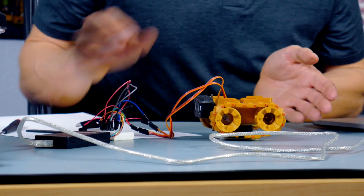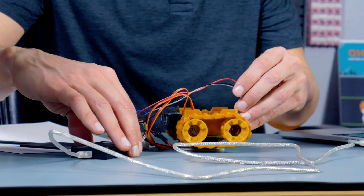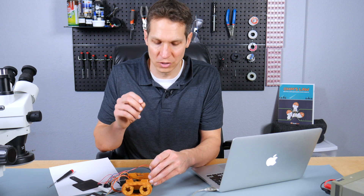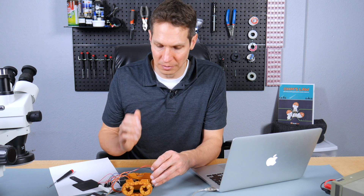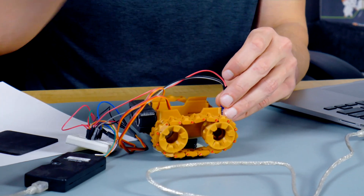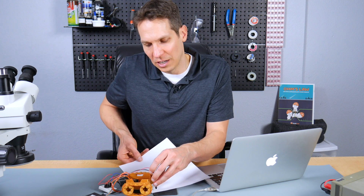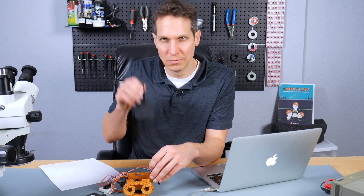Now you're seeing the front of the robot — in an ideal situation this would be mounted right there. You get the left track that is pretty consistent, and then the right track where I had to change some settings a little bit from what Sergei had, because I think my servos have a different middle point for some reason. So it's pretty consistent on the left track, whereas on the right track you're getting a little more inconsistency. And it's not only a light thing but also a reflectivity thing — if you have a sheen on your black surface, it's going to reflect more than a matte surface.